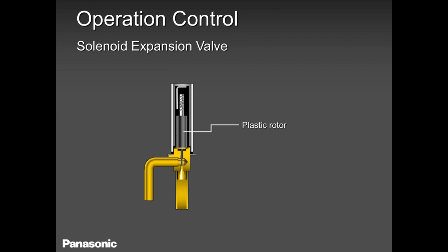This is the old fashion. Nowadays they have sprays, they have paste, you name it. Please use it so that there is not much heat being transferred elsewhere and damaging stuff. I had a guy change a compressor and by mistake, he didn't see the thermistor sensor at the back, and he burnt the thermistor. So that can be a problem as well. You've got to be very careful. No rush, guys, no rush. After the plastic rotor, we have a valve pin. All these components can cause trouble if, when replacing, you are not seriously thinking about using a wet cloth.